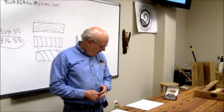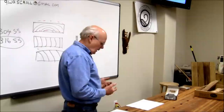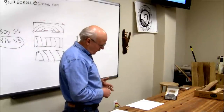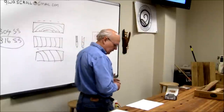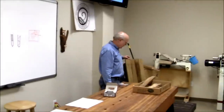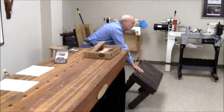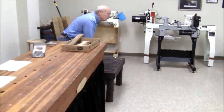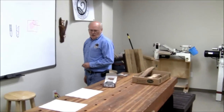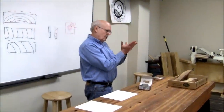Some design tips for when you're putting stuff together: allow for drainage of water, especially off a horizontal surface. For individual boards, you want spacing between them — you can see it on this bench — because you don't want water collecting. The amount of space isn't critical, but you want enough that if the board swells it doesn't close up the gap.